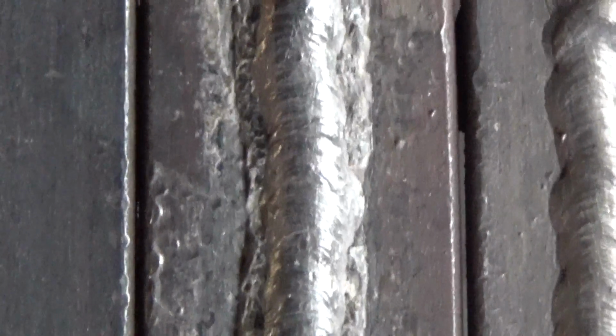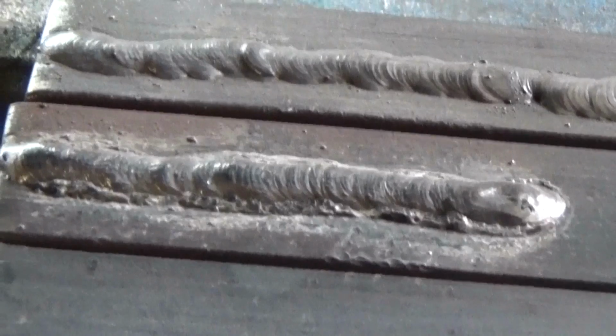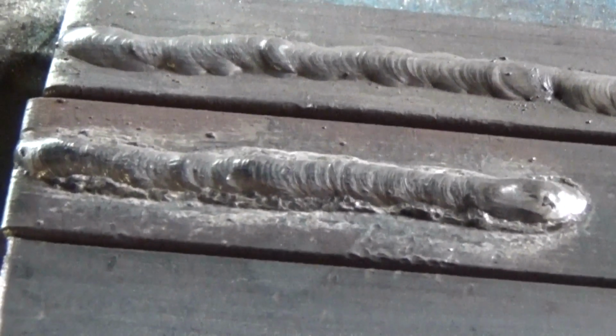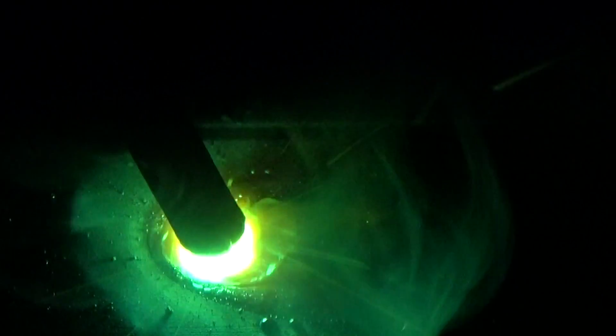In this case I would say that this is the optimum welding current. The metal puddle is well managed, welding is relatively fast, with low sputters. The liquid metal spreads well on the plate. Let's operate the electrode so that the slag is not running ahead or behind the arc, and covers the whole welded seam. Thus we protect the welded metal from the influence of the air. Pay attention to the final piece of the weld, the place where we finished welding.